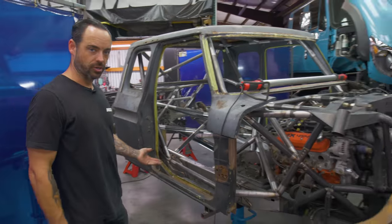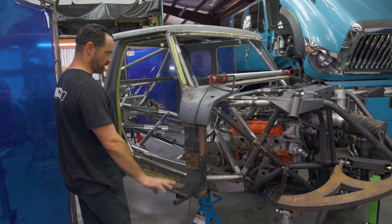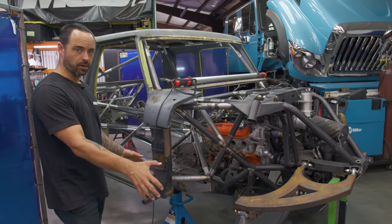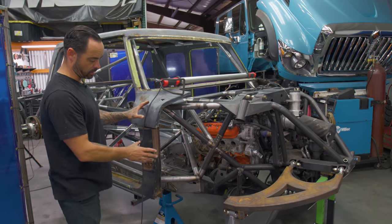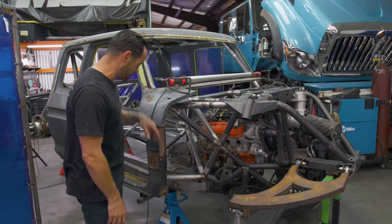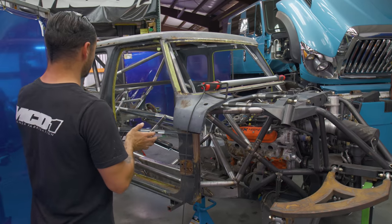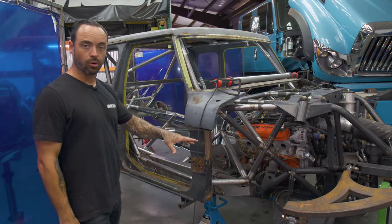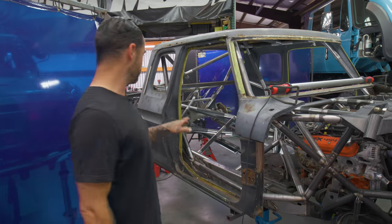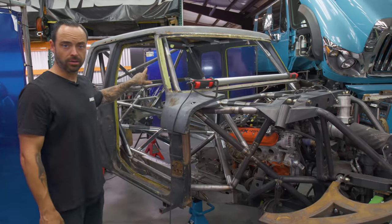This thing's probably got a 4-inch body drop on it right now. Was gonna be a 6-inch, it's a 4. It's very healthy, when the glass, like obviously what we talked about too, is getting a front tire on there, getting the glass temporarily mounted, and then figuring out exactly where this body's happy. So we're dialed now. That's where we set the cab, and what dictated all the packaging as far as centering on the frame. I know it's hard to see back here, and it's a little slot here. But there are some big changes we made back here that I'll take you through right now.